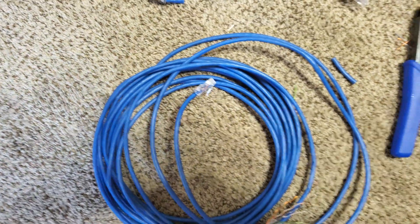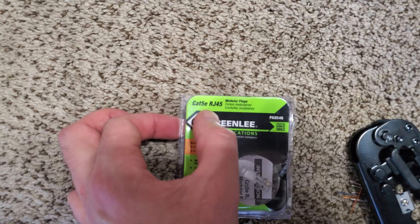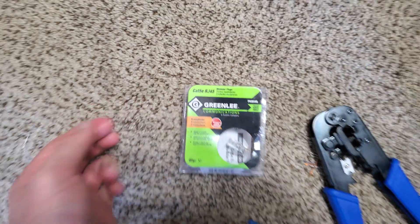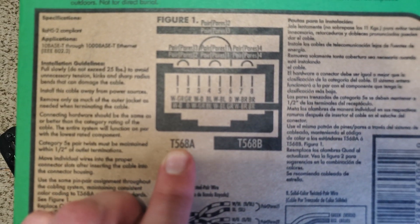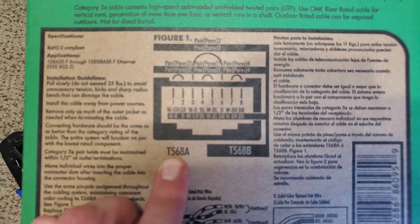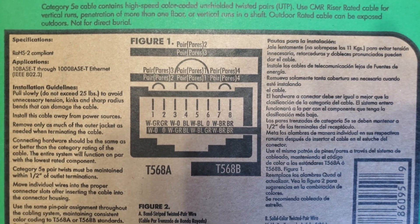The trick of it was just finding out supplies first. So again, RJ45 for the CAT5E cord, and then I used that specific method — T568A. There is the proper order. Hopefully that helps you out. Thanks for watching.